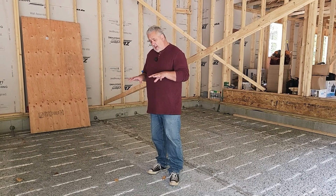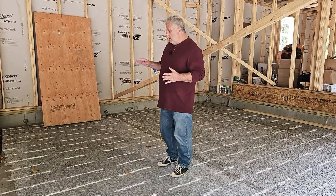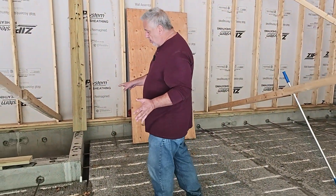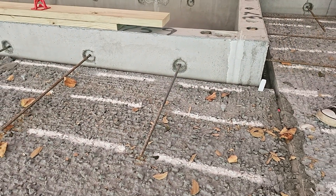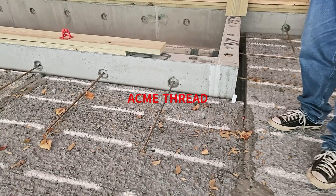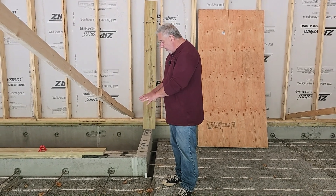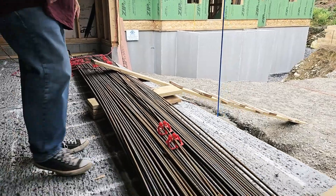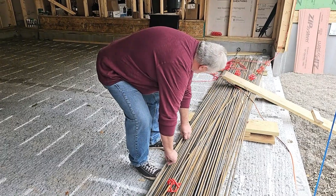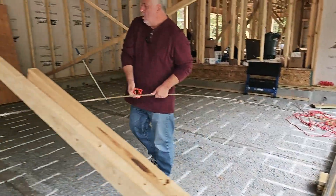One of the important things is that because we have these planks — and these are basically just gravity set — we need something to tie this floor together. When you look over here, all of our walls here were Superior Walls, and they cast these little inserts inside. Then we have a piece of Acme thread — sorry, not all-thread — Acme thread that comes through, gets screwed in there, and ties into the wall. We have ones on the opposing side too. Then we'll take the rebar — and yes, I'll grab a piece here, though I'll struggle to carry it over.